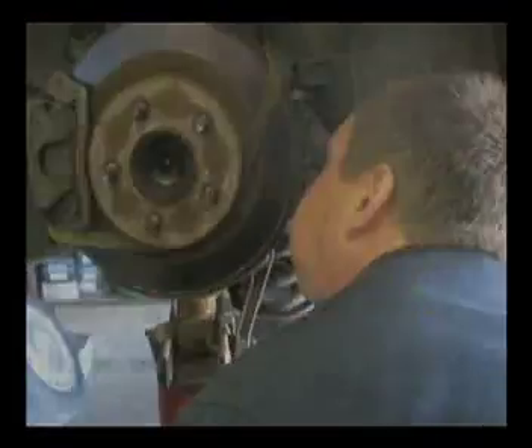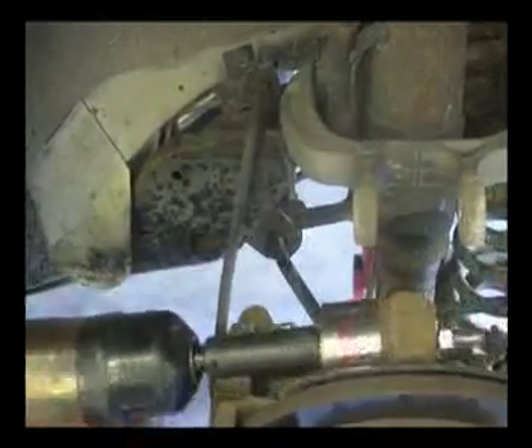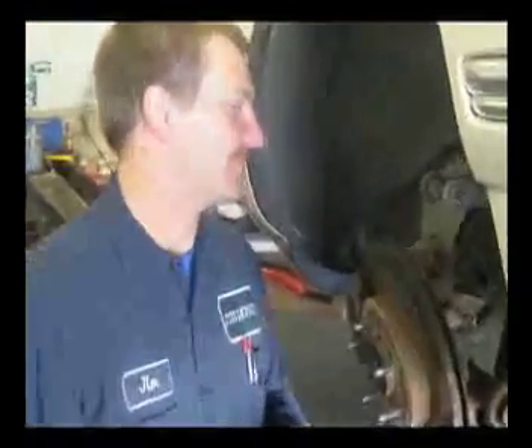A little clean up and we're ready to put the new one in. We're going to change the upper control arm bushing on this by simply removing this bolt — you can see it right here. Once we pull this bolt out, look at there — the top knuckle bushing is ready for removal. It's that quick. Look at that, the knuckle bushing is out of there. Did you see how that was done? You can see dollars when you're doing these babies.